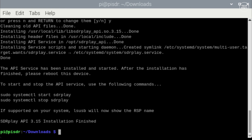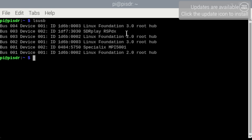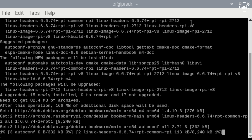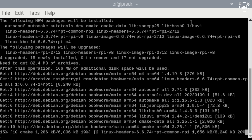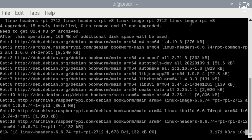Rebooting after installation saves any headaches when proceeding with the rest of the setup. If your SDR Play device is already connected via USB, type 'lsusb' in the terminal and you should see SDR Play listed. Now we need to install SoapySDR — you need this whether you're using RTL SDR or an SDR Play receiver. I'll leave a link to my GitHub page with all these commands. The first command installs CMake, which the Pi needs to compile the applications we're installing.